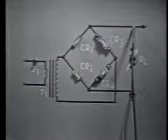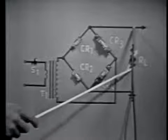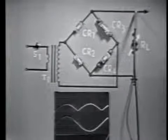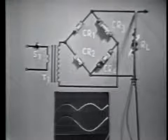The circuit is made operative by turning S1 on, which applies power to the transformer primary. The rectifier circuit consists of diodes CR1, CR2, CR3, CR4, and RL, a variable resistor. The circuit develops an output peak voltage as seen on this oscilloscope, which we've connected across the output. The lower trace represents the input AC signal, and the upper trace represents the output DC voltage.